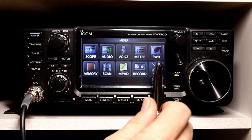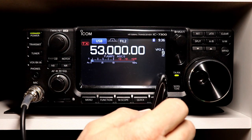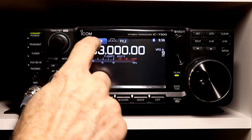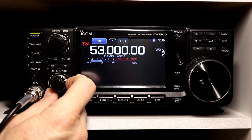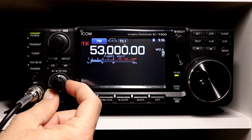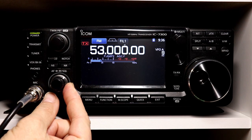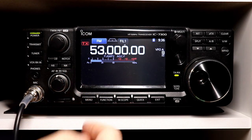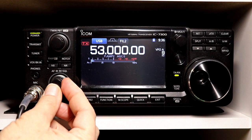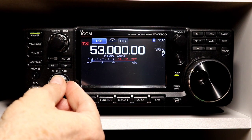If we go in and set it to squelch mode, then in that mode the knob operates only as squelch. In sideband mode it's a signal strength squelch, and if I go to FM it's a noise squelch. It goes by noise on the signal from about 12 o'clock to about the one o'clock position, and then it also activates the signal strength squelch even on FM. But as I go to the left, it doesn't decrease my gain. And if I go back to sideband mode, you'll see as I go back down the RFG or RF gain symbol doesn't come up — it does not change my RF gain at all.